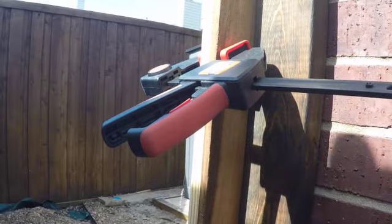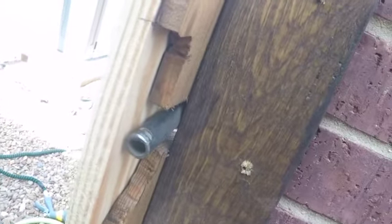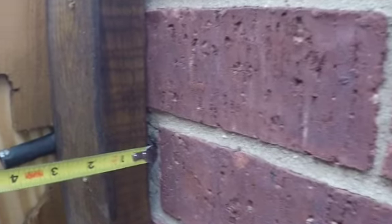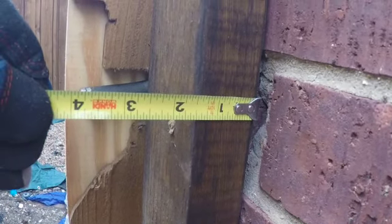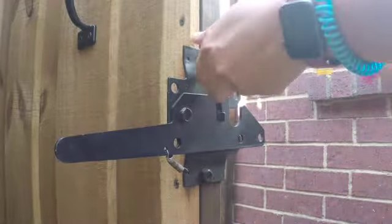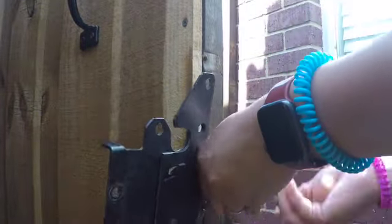We are going to clamp board B to the B side, and this is why we did not remove those two boards where the latch post is. You can see I marked with a pencil where we are going to cut out a notch. We also need to know how deep we are going to cut by knowing the thickness of the post - looks like it's one and a half inch. That one and a half inch tells me the depth of my notch cannot go past that mark. Next we want to remove the latch on the opposing side because this is going to be in our way - we want accurate measurements. We are not removing side B boards; we are keeping side B boards in place because we still need measurements to be transferred over.